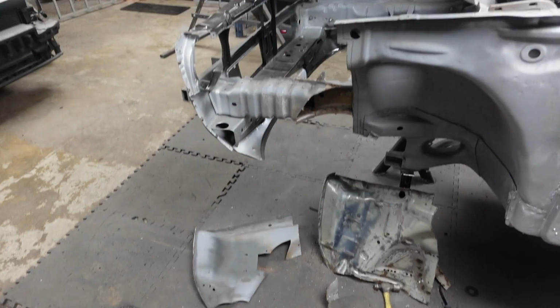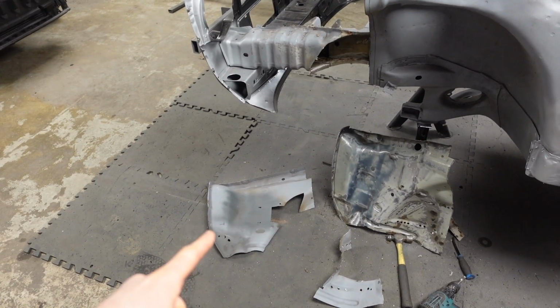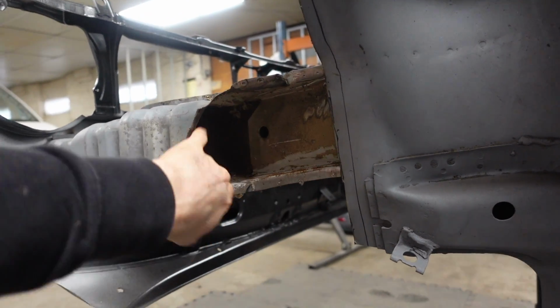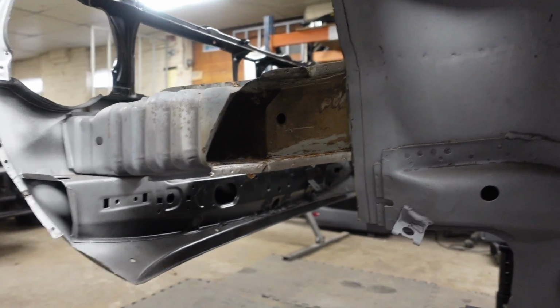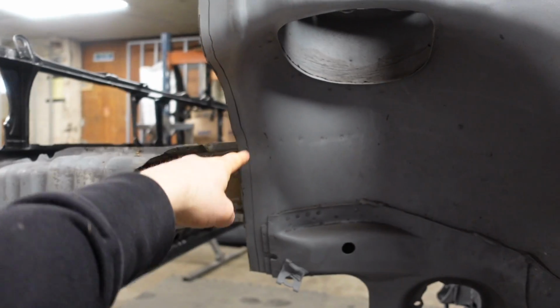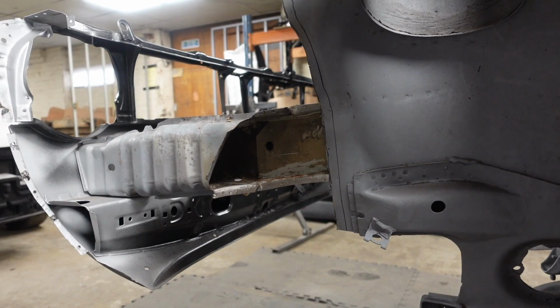There we go then, there's that removed. Bit of a hole in the car now, so we've got the new one to go in. Old one we cut in bits and drilled out, and the chassis leg is looking really good and really nice in here. Bit of a cleaning up, we're going to get some of the wax oil and whatever off as well. Now, you see here, this is the line that I drew on the first time, leaving obviously a bit more material on. So we'll get this clamped into position now and work out where we need to cut it.